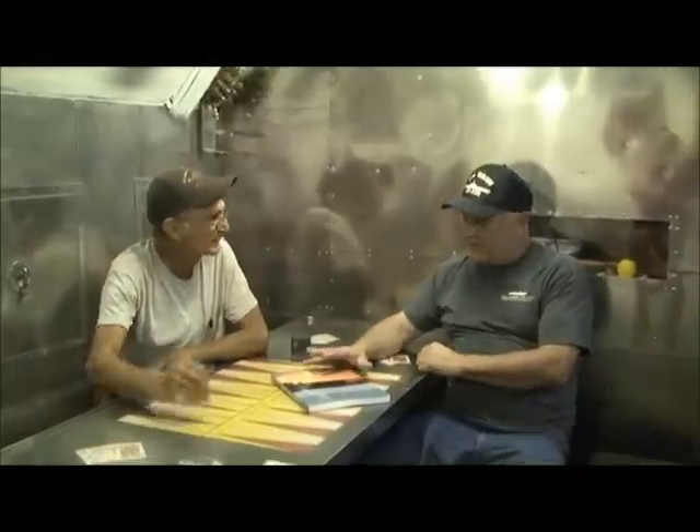To sell the lead ballast — is that just for the scrap value? Yeah, fairly high, and we had 116 tons of lead. The lead from that time — is it purer? Yes, this was pure lead; today they've got a lot of impurities in it. The scrap people were very happy to get it and actually gave us two people to help get it out of the tanks. The lead was in 50 and 100-pound bricks. We had to go inside and cut the straps off, hung an electric winch on the inside of the tank, made ice tongs to grab the lead with, dragged it up to the hole, and dropped it out onto the pallet. 116 tons of ballast was in this boat.